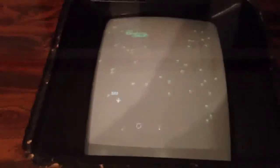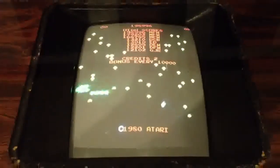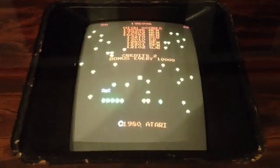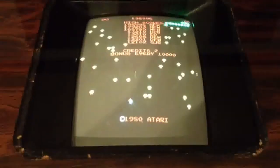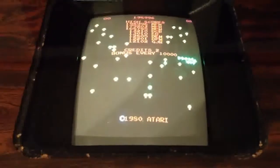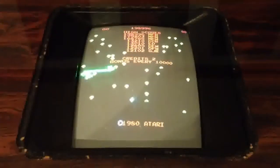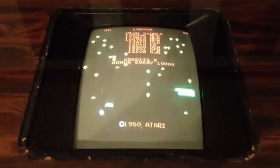I've gone ahead and put the G07 back in the Atari centipede cocktail table. I'm going to plug it back in and we'll see how it looks. There we go — that's the G07 monitor we just got done recapping, put back in the table, plugged back in. As you can see, the picture looks really good and should hold up for quite a while now due to all the caps being replaced. I hope you enjoyed the video and hope you learned something. Thanks for watching.